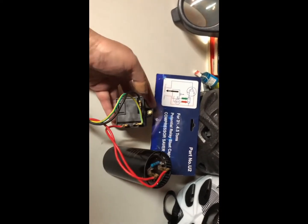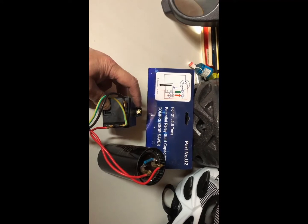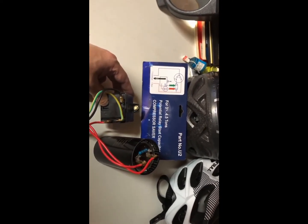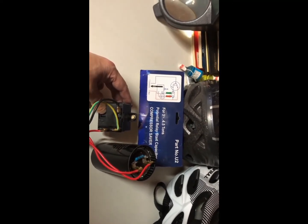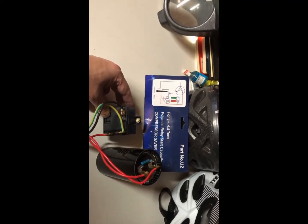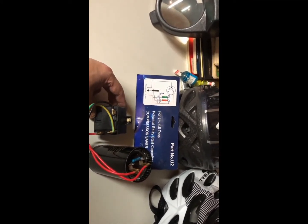The reason I'm installing this to my unit is because I want to use my 8000 running watt generator to run my 3.5 ton AC unit. I hooked this one up so this thing can pull my generator — because it kicks on so fast, the generator didn't even see it. By the time the generator sees the current, it's already at running current. That's why my generator is able to handle it. Otherwise I would need a higher generator, like maybe 12,000 watts.